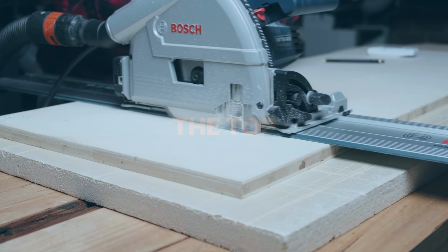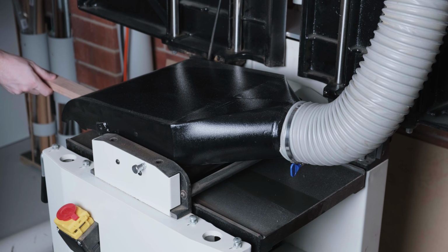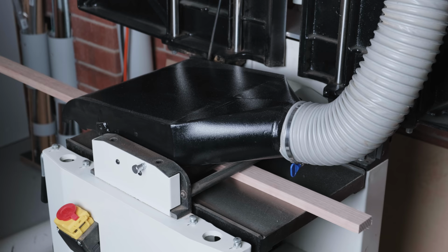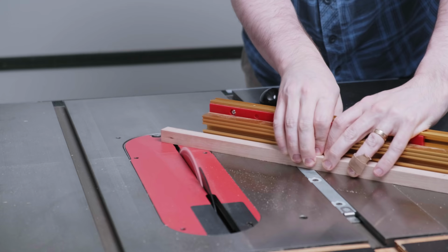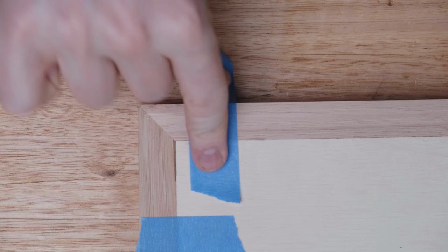The first step is to get the block board sized. I need to know what size that'll be so I can make and apply the solid edge banding. Then I'll know what size to make the veneers. After cutting the mitre on one end of all parts, I could press them together and start marking exactly where they came to.